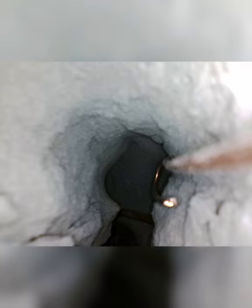As you can see, we're already inside the wall and you'll see we managed to hook the cable. But what actually happened was a bit of breeze block crumbled and fell apart on the boards, and it stopped us from getting our cable out. So we went in again, thought maybe we could just wiggle it around and push it out the way, but that didn't really happen. So we decided to get a screwdriver and do the only appropriate thing — push it out of the way. We managed to do that, so we went back into that cavity, found the cable, hooked it, and this time we did manage it. Our draw wire is now through the floor and coming out into the wall — we're ready to pull our cable in.